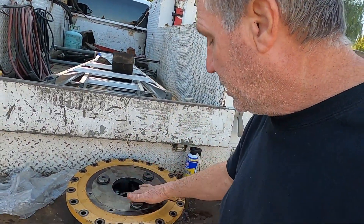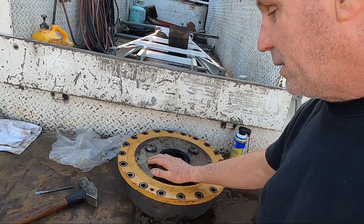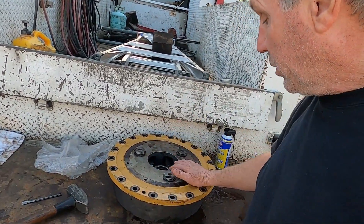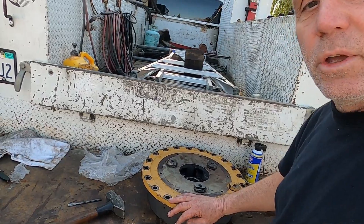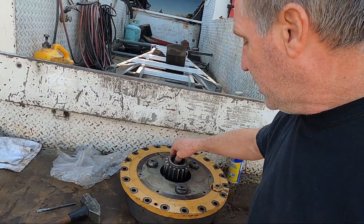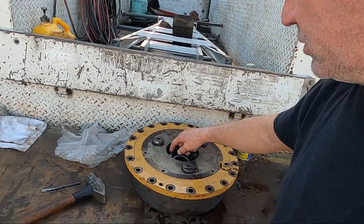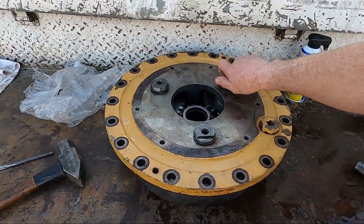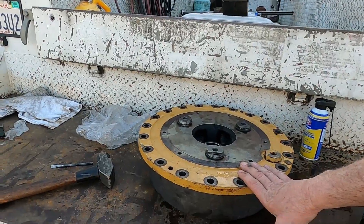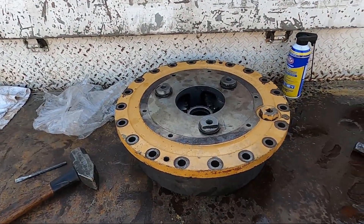That's it - these things aren't very complicated at all, it's just making sure everything's right so it'll last. This one's a little beat up - probably 85% of what I wish it was, but it's going to work for me. I need to keep my eyes out for some good used ones - every once in a while you can find a whole assembly, but most used parts people know they can sell each gear separately and make more money that way. Anyway, that's it - a wheel planetary assembly from a CAT 735 rock truck, a 35-ton truck. Monday I'll go out and install it and hopefully get the machine back up and running. Thanks for watching and have a good day.